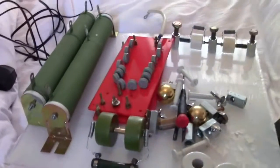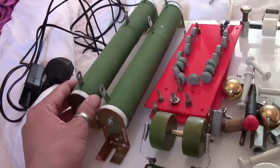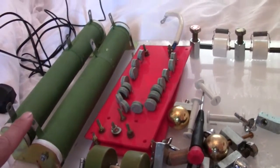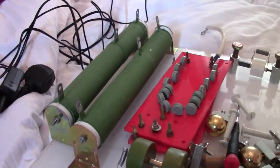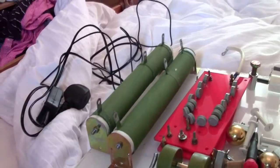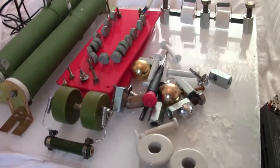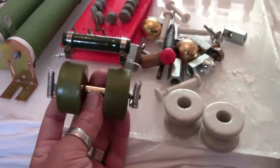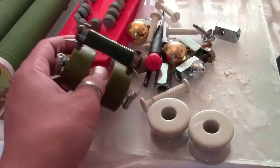The other thing I've been planning and working on is my Terry filter. I've got two 300-watt resistors here. The optimum value is 1k ohm, but these have optional tap points — between here and here is 2.2k ohm, so if I link those two together it gives me 1.1k ohm at 600 watts. I'm waiting for the other two to arrive in the post, so I'll have four in total: basically two 600-watt 1.1k ohm resistors. The plan is to have two inputs from the neon sign transformers going directly to that capacitor.